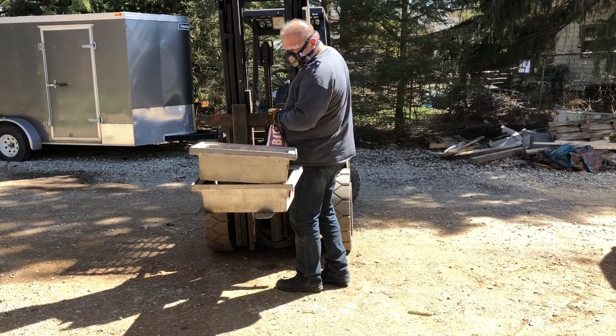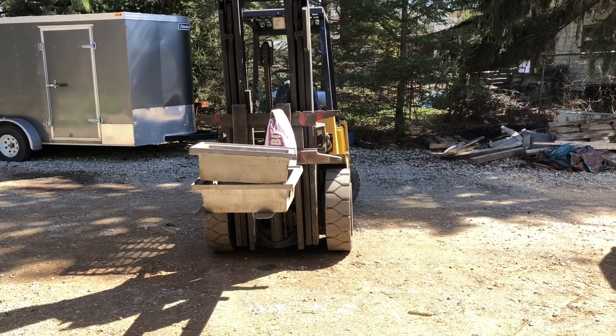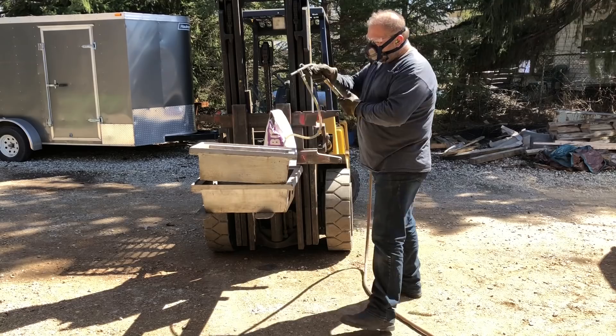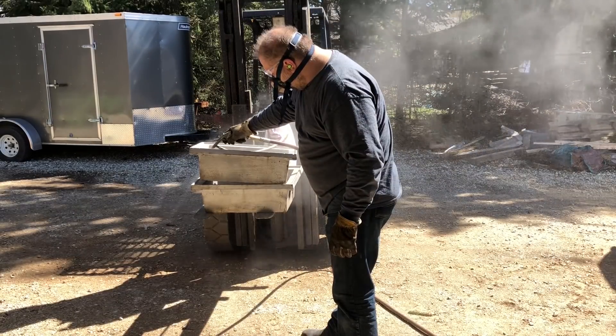The customer brings over these metal boxes and there's some sort of casting. They're cast iron — one of the worst cast irons I've seen in a long time, it doesn't want to weld to save your life. The key is cleaning it up, so I'm getting a spot blaster gun out with some glass bead abrasive and giving those a good once-over. I did a spark test and the sparks are absolutely dark, very few of them, so we're pretty sure it's cast iron.